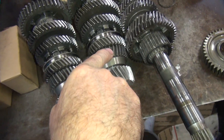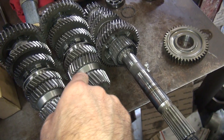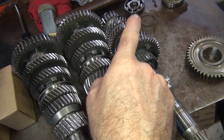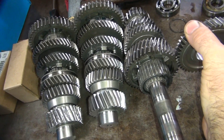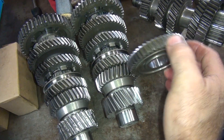See these two gears? See how they're chevron shaped — you know what that means? Angle. See how these two are not angled — they're opposite. So that means these don't match each other. This gear right here needs to be swapped out, and then it will go on to this one like this and it'll work.